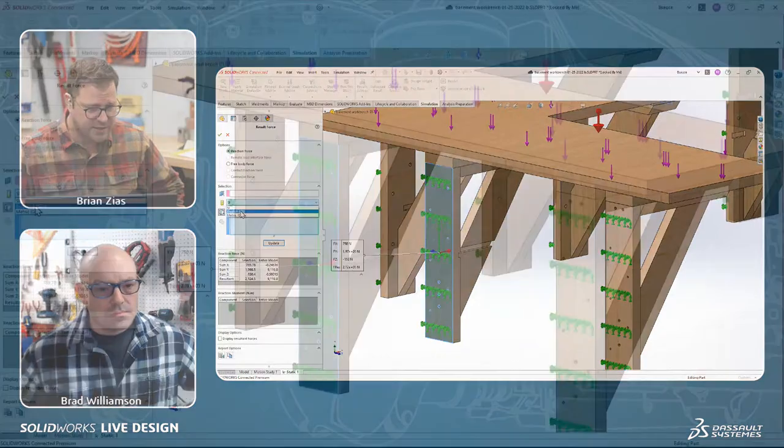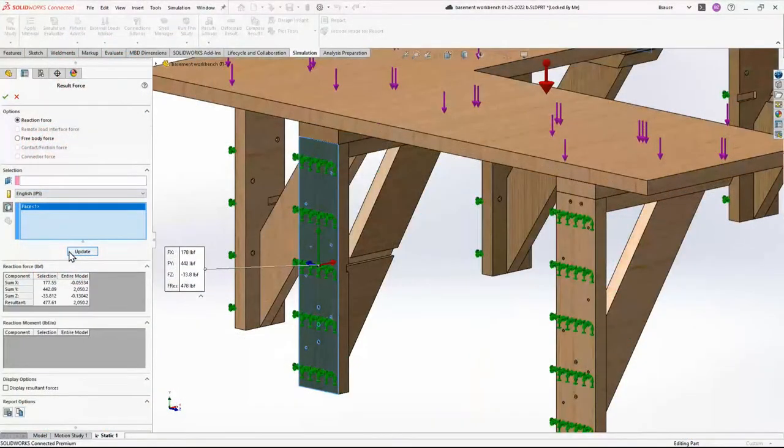And let's do it in inches. Okay, it's actually not that bad. But so for this whole face here, I have a shear force of 442 pounds and an outward force of 178. Now that's in bending, so again, it's not as accurate. But first of all, how is that going to be distributed amongst the fasteners? I have 6 fasteners, 442 pounds of shear. I don't know what the allowable is offhand for those quarter inch Tapcons, but I'm pretty sure it's in the thousands of pounds. So by the time you do this, I felt pretty good.